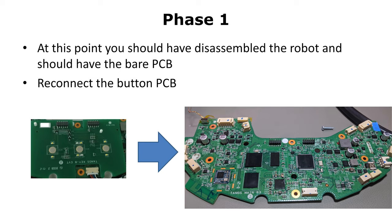In this step, we need UART again. So if you disconnected it before, then you need to reconnect. We need to boot the Ubuntu Linux, which can be done by a printed command or by just re-powering the PCB. As soon as your device has booted into Linux, you will see the prompt for the login. Use user root and the previously calculated root password. If the login is successful, the first thing you want to do is type iptables -F. This will disable all the firewall rules and will enable SSH. If you are holding the cables, you may release them now, because the rest of the steps can be continued over SSH.